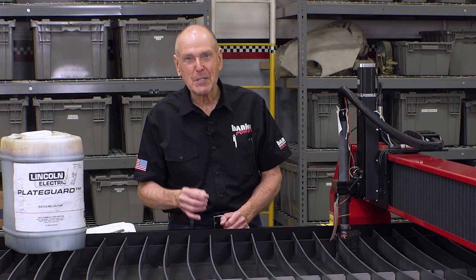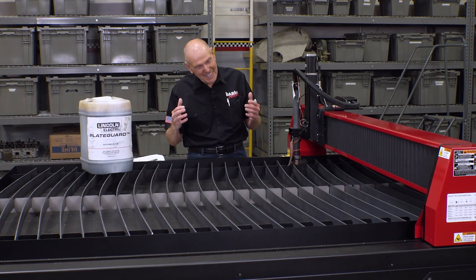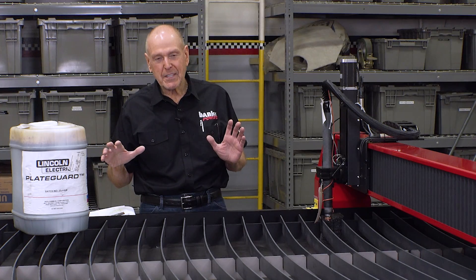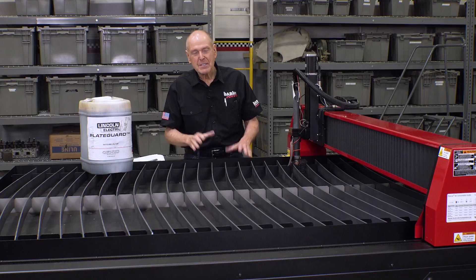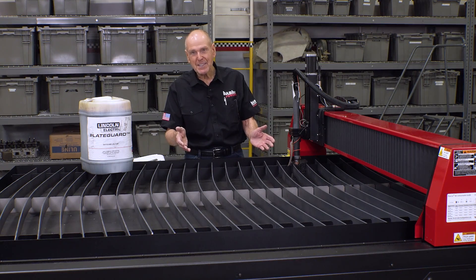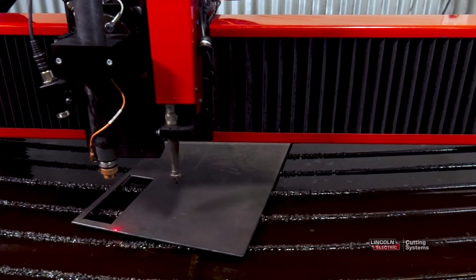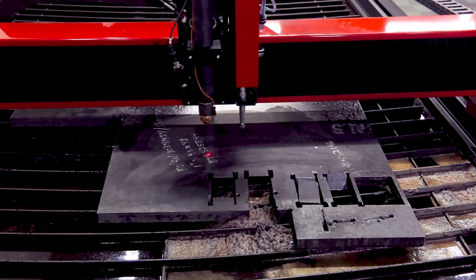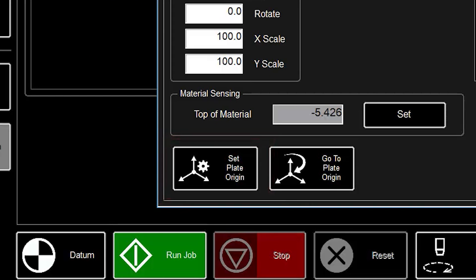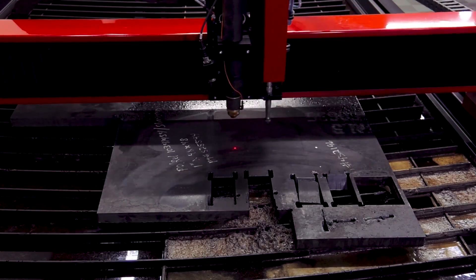This is a good part because I get to talk about the laser. Why do I need a laser on this thing? Let's say you pick up a piece of one-inch plate with the forklift and put it onto the bed, then you discover it's not quite square. Rather than punching it around — imagine you've got 2,040 pounds of steel, you're not going to easily square it up. The laser takes care of that. It will go to the corners, put those locations in software, and adjust the entire cutting program to the true position of the sheet. A lot of tables have a square in the corner and you jam the plate into it, but when you get big, heavy stuff, that's not easy. The laser solves the problem.